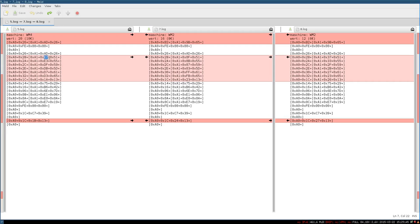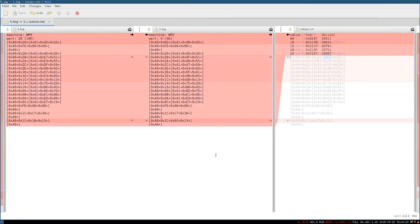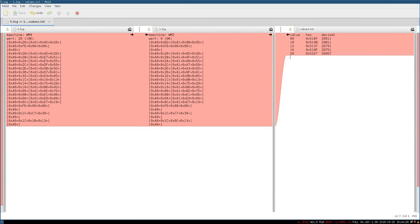And another thing which is important is here we see that this value is changed. So this encodes somehow 20 points, this encodes 16 points, this encodes 12 points. So here I've taken several dumps, or several traces. This is for 20 points, which are on the card. This is for 0 points. And as we found out, the value is only stored within here. The following are just variations of this. So we're only interested in the value which is stored at 0x28.